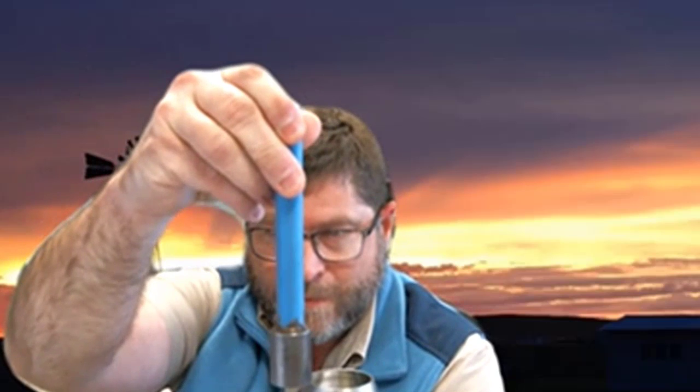While you've got the cone and the tamper there, and again, this only applies hopefully to those people doing mix designs and possibly aggregate production tracking, for proposed mix design purposes, is the drop of the tamper, the 1/10 of an inch. And I think that's probably led to some of our variability. You get in a hurry sometimes, and that's not much of a drop, and you're repeating it across the full face of the cone. So if you're having troubles correlating, sometimes that's the issue. Your 1/10 of an inch might be my 1/4 of an inch because I haven't done it as much.